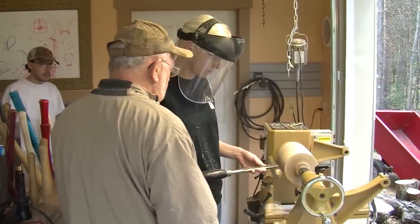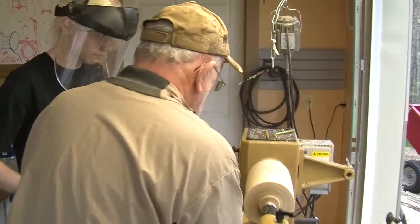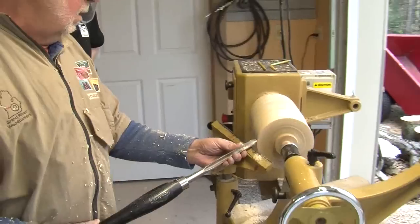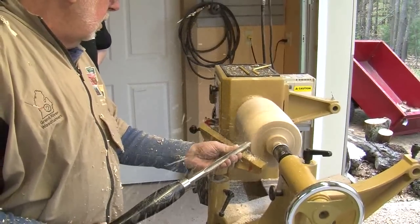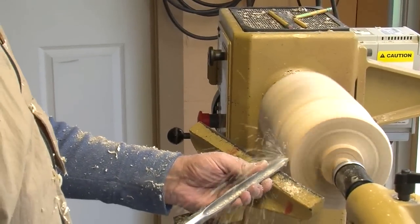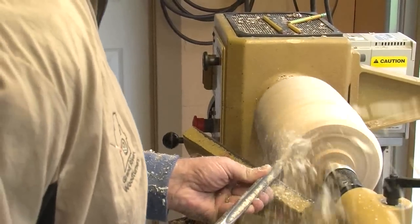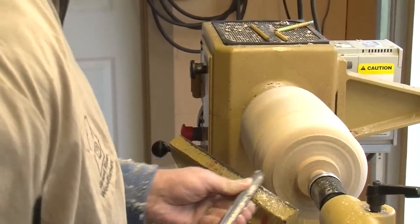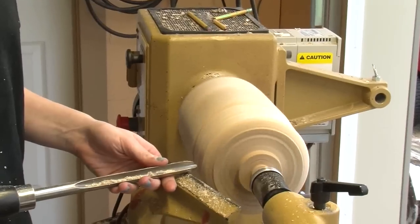Now I'm going to show you how to make a curve. You want to round this bottom over. So your first cut is going to be on top. Watch your camera now so it doesn't come at you. Like this. To make a curve, you can't make a continuous curve all at one time, hardly. So you do here, come back to here, lean in, and come around. And it's all in your body movement. It's not in your hands as much as it is your body.